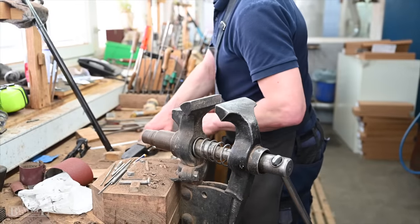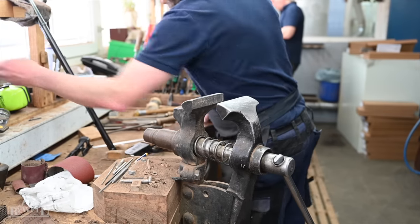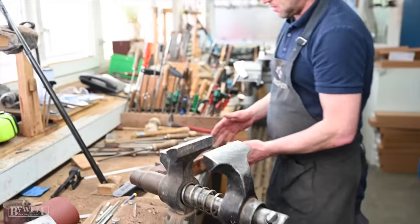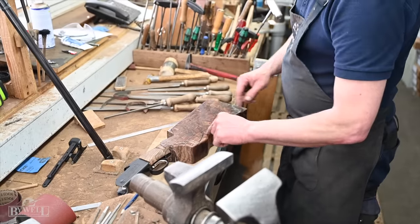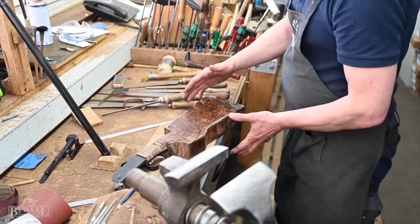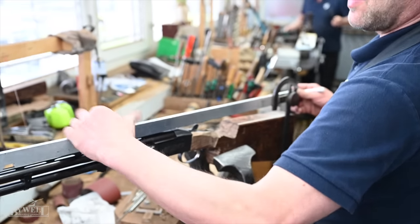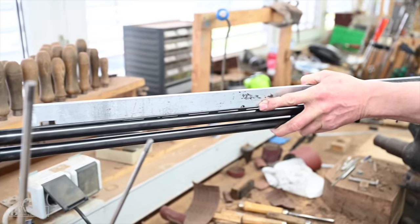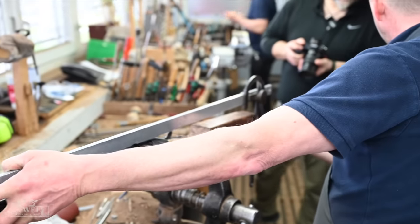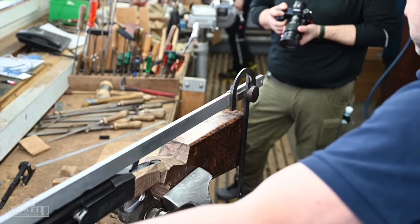Right. Okay. First we start with the length. Normally on each handmade stock we start the same way. We do it at first the borders: the drop, the length, the pistol grip length, pistol grip height, the radius here, the thickness here, and if you have the complete shape, if you look at it, then you start the next step with the casting. So do everything over the rib, and the good thing is we do not need three measurements, the top, the middle, and the bottom. We just need the middle, and then we did the pitch. And the pitch from the angle. That stock is 5 degrees. So we have the 5 degrees, and that's it.